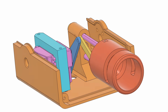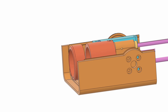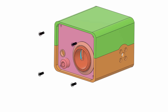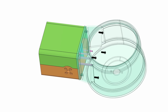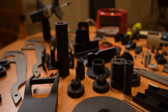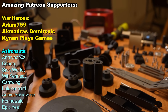Now we've got a complete recoil mechanism that provides clearance at the center of the barrel, as well as the ability to retract safely within the housing. The front face of the forward housing has separate bezels for the LED sensor and barrel that simply screw onto the lower and upper pieces of the forward housing. I can attach the rear housing via four more screws at the rear and pop on the cap. There are a few more components that I'm keeping secret as a surprise, because this is a sentry after all — it's got to fire something. We'll talk more about the electronics and how this all comes together in the next video, where I build it and put it to the test.